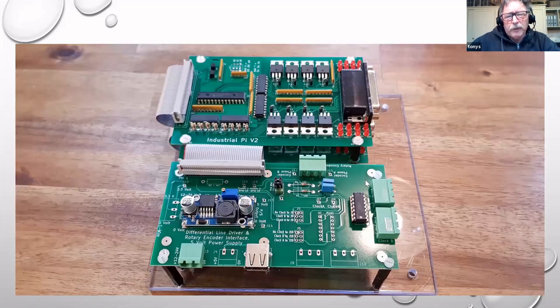Above the Pi I've put another card that I'm going to redevelop. I put in 24 volts on the bottom left because most industrial systems work on 24-volt DC. I've got a 24-to-5 regulator and put the 5 volts straight down the ribbon cable to power the Pi through the ribbon - that works quite successfully. The I/O cards have their separate 24-volt supply going into a 25-pin D connector. I also use a lot of Phoenix two- and three-pin connectors - they lock in and don't fall out.